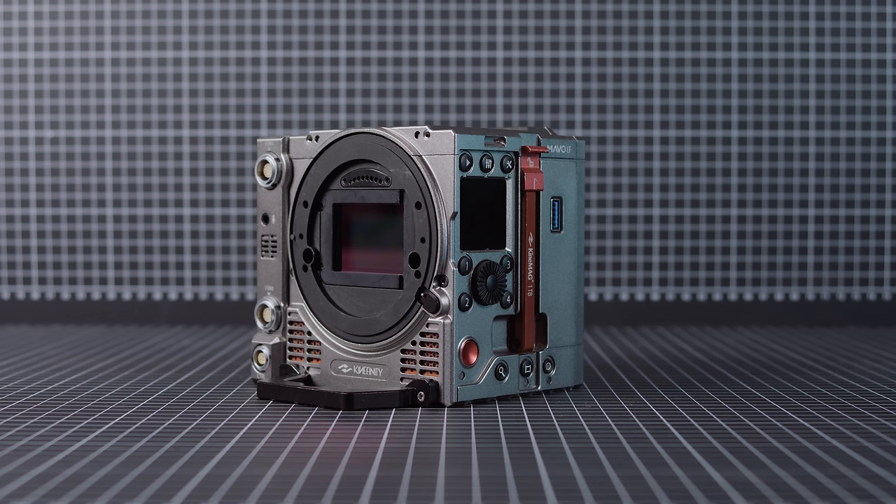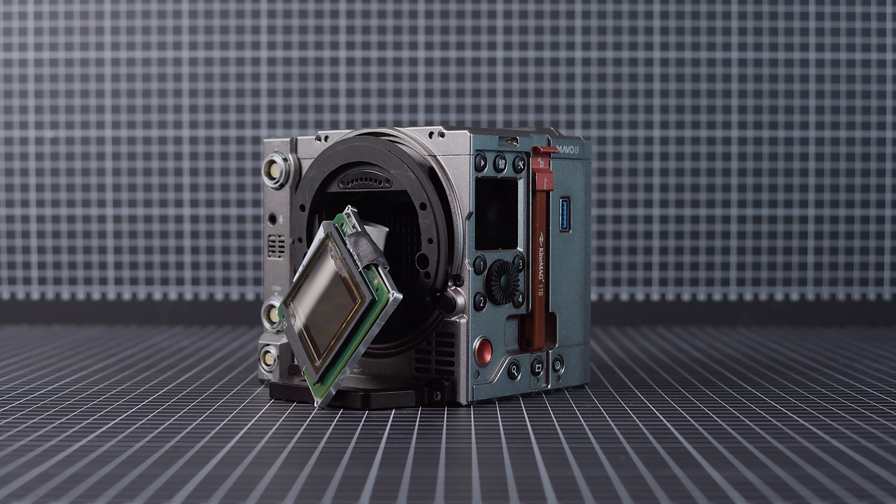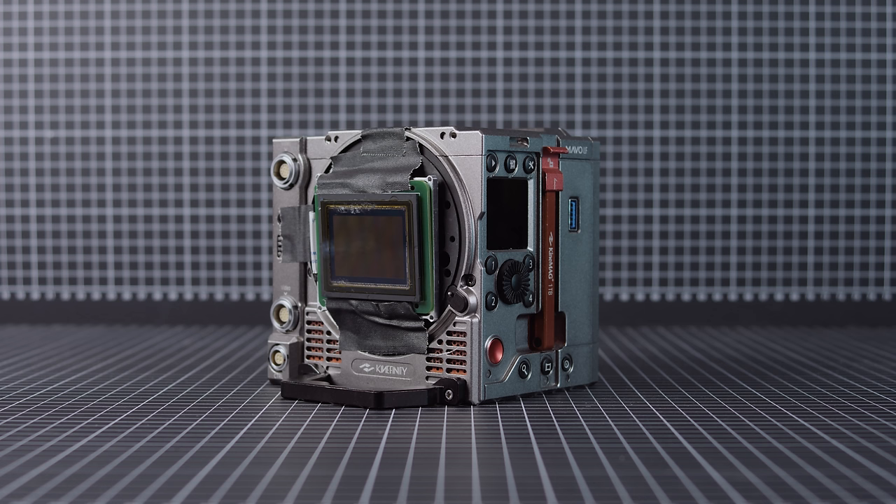We're not doing this because we hate our camera — we just like to be bold and experiment. Like Kubrick, we don't take no for an answer. We remove the sub-mount, then the OLPF — which on its own would have been thicker than the required 4mm flange. We detach the sensor holder and sensor unit, reattach the heatsink with adhesive, pull the sensor through the opening of the sensor holder, and attach the sensor from the outside. We are now lacking an OLPF and infrared filtration — we can live without the OLPF since a wide-open lens is very soft, but not without IR filtration.